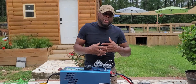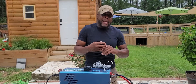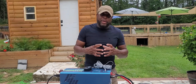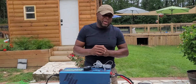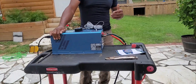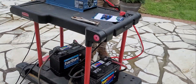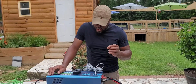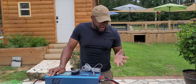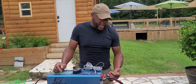When you go to the battery bank, you want something that's rechargeable. You don't want just a regular car battery. You want something like a deep cycle marine battery or dual purpose battery, where you can actually draw it down to a certain point and bring it back up. You don't want to do that with a regular car battery — after you drain those, they're no good. You want something that can take a discharge and bring it back up. Marine batteries are efficient and we've used those for years in solar, but you want lithium — the LiFePO4 batteries, which are awesome. Those charge quicker and give you a lot longer power over acid batteries.